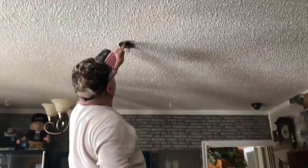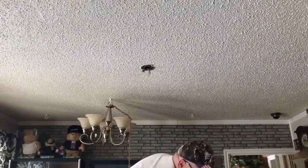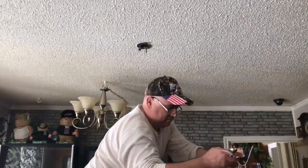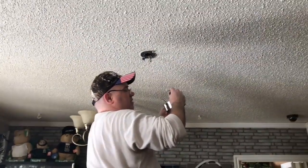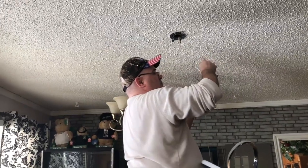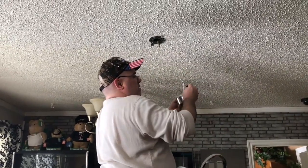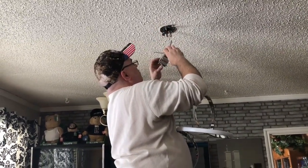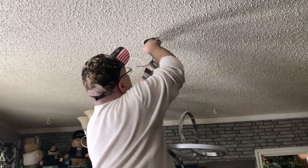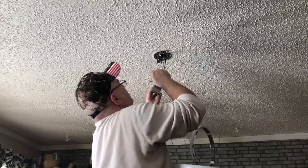Now it's time for the light to go up. So where your anchor is going to go, folks, is right here. There's one big hole. That's where you're going to hook your anchor onto. So do your anchor first, so if it slips out of your hand, you're not going to destroy anything on your table below it. Let's get this all way here. That way you can go a little bit hands-free, and make sure you got these little holes on the side of your plate here that you're going to have 2 screws I took out earlier. That's what's going to hold this whole thing into place.